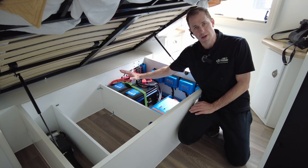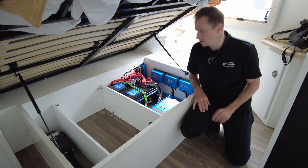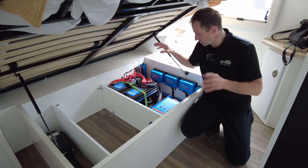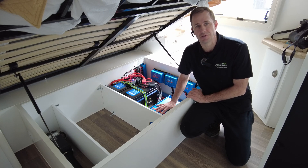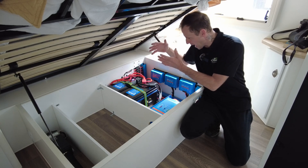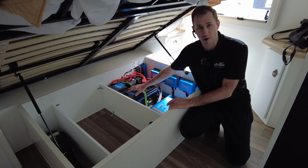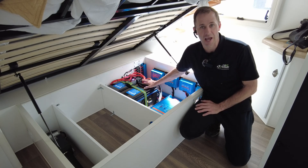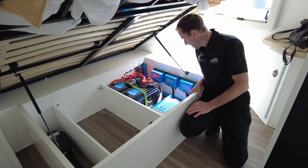We've got 560 amp hours of Powerpall lithium — two 280 amp hour batteries. The customer pre-ordered these months ahead of time, direct from Powerpall. That's 560 amp hours with a continuous discharge of 250 amps per battery, so one battery alone can support the discharge of this inverter. That's great redundancy — should a battery fail, you've still got one battery running the inverter. Combined, that's 500 amps continuous, but we always de-rate that and work on the ability for the inverter to run from one battery, just in case.